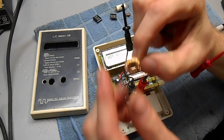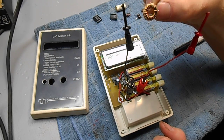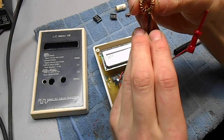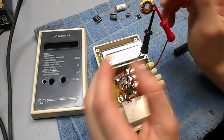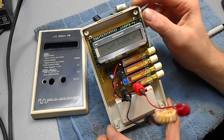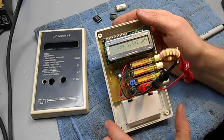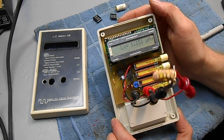Here's a little example of a toroid I wound up. I was aiming for about 1.1 microhenries, and we're getting 1.154 or so. On toroids like this, you can adjust the spacing on the windings if you want to fiddle with the overall value a little bit.